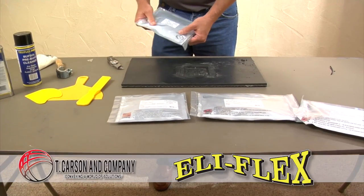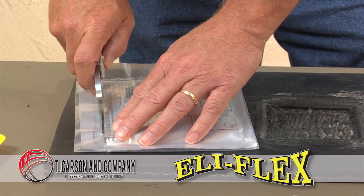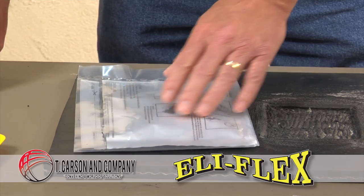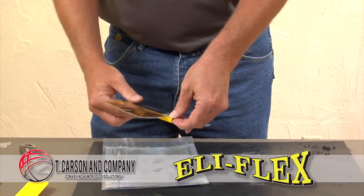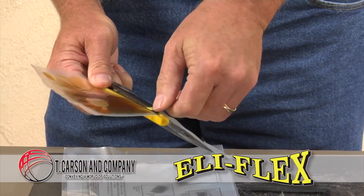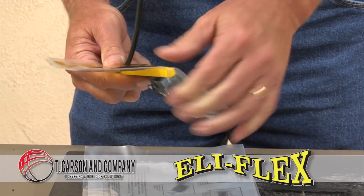Open the resin pack by cutting the aluminum foil along the marked lines, making sure you are outside the plastic divider when cutting the pouch. Once the resin pack is out of the foil sleeve, grasp both sides and gently pull apart until the separator pops up. Carefully slide out the separator and remove the divider clip.